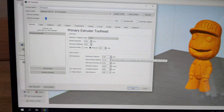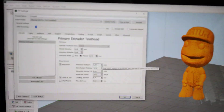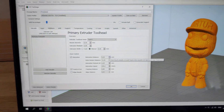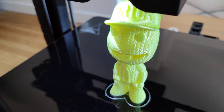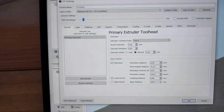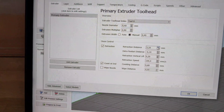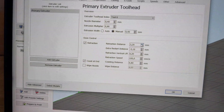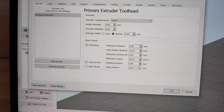I think I made a little bit of a mistake and next time I'll go a little bit higher — I'll try 4 millimeters or something. I think when I do that, my stringing will disappear completely. Extra restart distance is minus 0.10. Retraction vertical lift I always use because sometimes when you're printing difficult models you must have this.